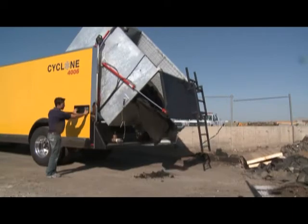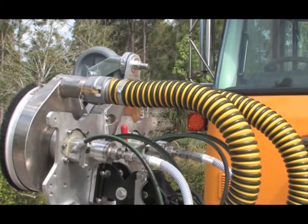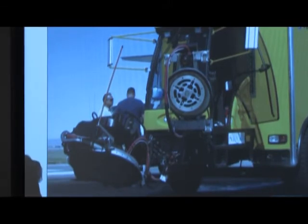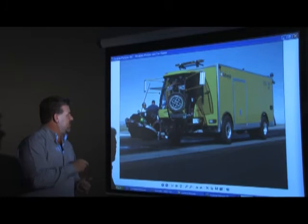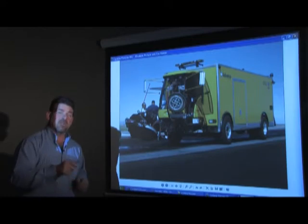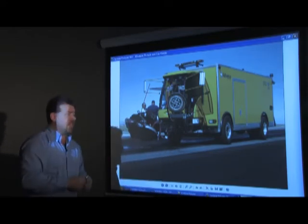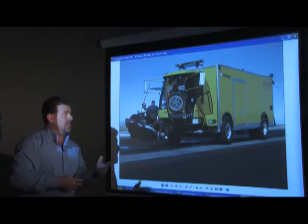So how does that happen and how is it different from a StripeHog vehicle? Whereas a StripeHog has a four-inch hose that leads to a debris storage tank, a Cyclone machine has only a one-inch hose that leads from the heads into the debris storage area. As long as you're mixing rubber with a fairly large amount of water, the pumps located on the heads have the ability to transfer that water and rubber successfully through the one-inch hose. But interestingly, we can't find any videos except about a seven-second clip where the Cyclone machine is removing paint. We have it on pretty good word that the pumps necessary to move that debris are not capable of transferring paint chips and heavy paint materials, including thermoplastic or tape, and other markings commonly used, into the debris storage area.